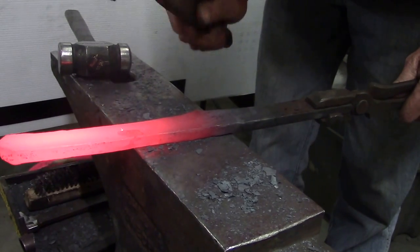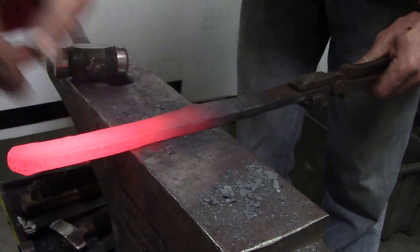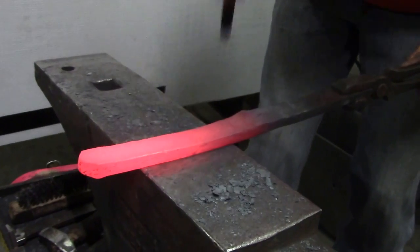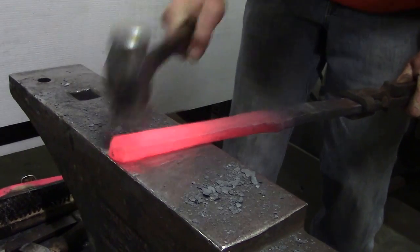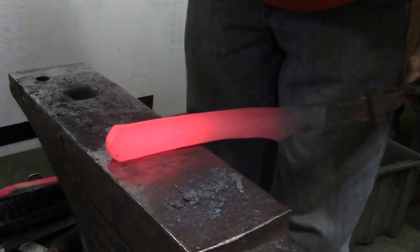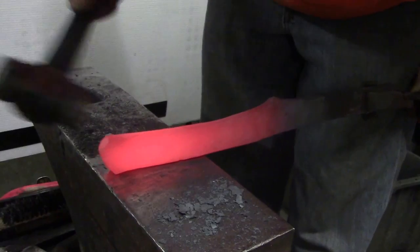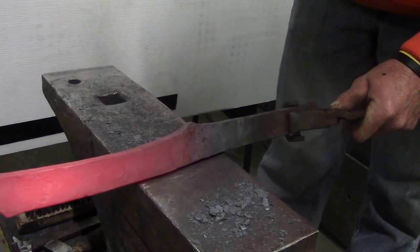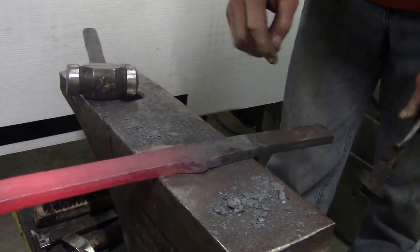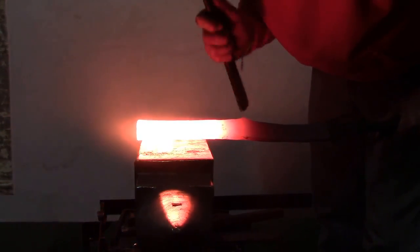Get this stuff off of there. All right, this is the inside edge, so I'm gonna come flatten on this side. Flatten on that side. Crisping up this heel a little bit. Plenty of material. We'll go to the inside and make an inside heel. On this medial heel, we'll just grab the edge, come all the way down, grabbing the edge, and then go over the top.